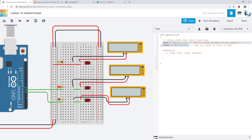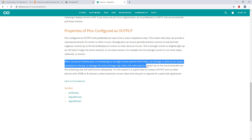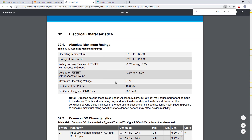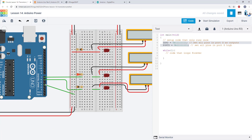Let's look at what happens if I add a short circuit directly between one of the I/O pins and ground. Looking at data sheets for the Arduino or the ATmega328P, we see warnings that short circuits on Arduino pins or attempting to run high current devices from them can damage or destroy the output transistors or damage the entire chip. The Arduino Uno specs suggest a limit of 20 milliamps per I/O pin, and the ATmega328P data sheet states an absolute maximum rating of 40 milliamps per pin. With a direct short circuit we would expect to exceed that 40 milliamp maximum, but if we run the simulation we don't get any icons or warnings telling us something bad would happen.